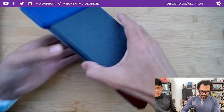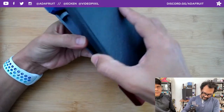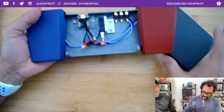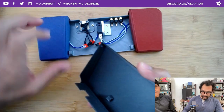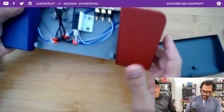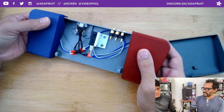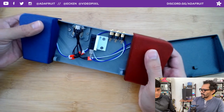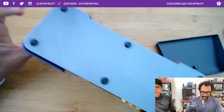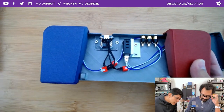There's a little pivot point on the bottom. Looking inside, you can see how everything lays out — it just rests right on top and pivots along two extrusions with little dimples that hold the lids or buttons in place. It just rotates around that with enough space to prevent any grinding of the PLA parts against each other. Someone mentioned they'd printed a foot switch before and it was just filament scraping — you just need clearances between your mating surfaces.